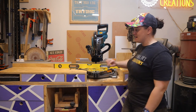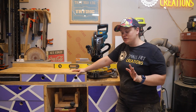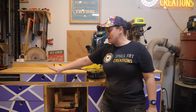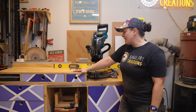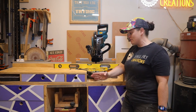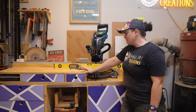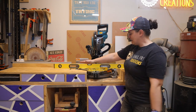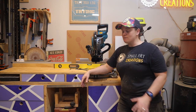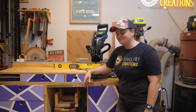So it does mean I'm gonna have to pull the top section off. This is why when you build workshop furniture, don't use glue. I've done this on purpose. I can pull this off, shorten all of these pieces by 3 mil, put the top back on. I am gonna have to push the fence back also, because I don't want it sitting any further out. So I'm gonna move the fence back also, which is not a big deal, but I'm gonna go ahead and do that, get it down so that it's exactly level to start with, and then I can work out if I need to make any more adjustments before saying it's in its place and move on to the vacuum.